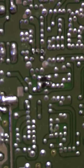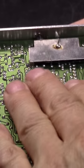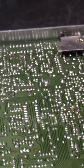Let's see, where's that in the camera? Focus. See it? They're really not soldered. I'm surprised it was receiving. Diodes look factory. Got a broken joint. That could have been anytime, anywhere. These often break. I've got videos that also cover this on the best ways to help save these radios so they don't get beat up so bad.